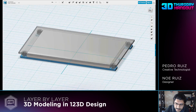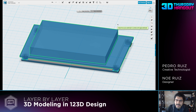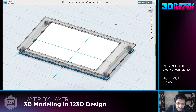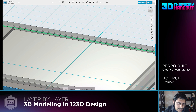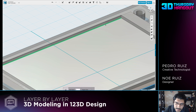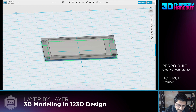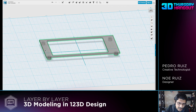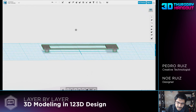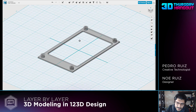I'll show all the meshes and then subtract the bracket from the screen cutout. And there we go - there's our little bracket. One last thing I'll do is apply a little bit of fillets to the corners so that we have a nice rounded corner giving it a nice aesthetic look. I'll put in something like 2 mil - that seems to do good, not too much, not too little. You'll want to save it out at this point so you can reuse this component. Before you export it out to print, we'll need to orient it in the right way. Hit X on your keyboard until it flips right, then D. Now it's flat in the center exactly how we want.